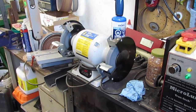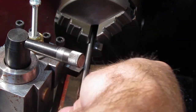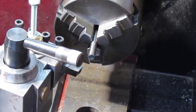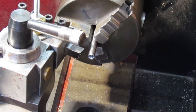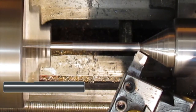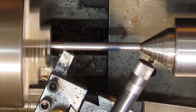First, a little machined area needs to be removed from the material. The crankshaft is easily made for this engine — a five millimeter shaft is all that is required. Over the years I have disassembled many scanners and printers and save the materials for later projects. First thing is to center drill the shaft, which will allow a tailstock to be used with a live center to hold the shaft when extended. Only a little material had to be removed. I used too sharp of a point on the cutter and didn't get a smooth finish.